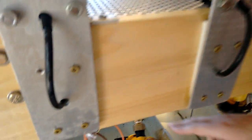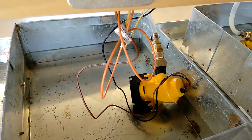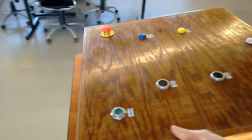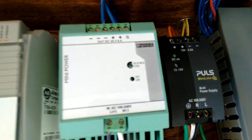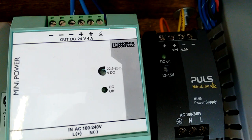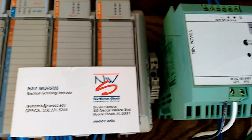Next is our pumps. Each pump individually draws two and a half amps, and we have three of them, but our power supply could not handle all three working together. This power supply can only handle four and a half amps, so I had to write it in the program for only one pump to be on at a time. If two ran together, it'd burn this power supply up and we'd have to buy another one.